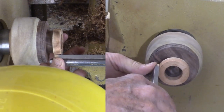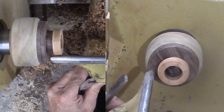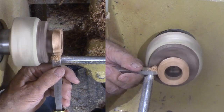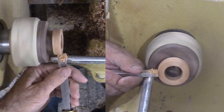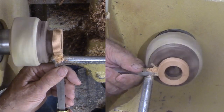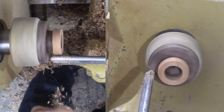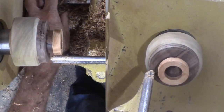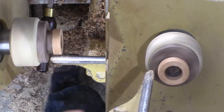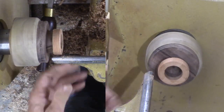As for the lathe speed — get over it. Remember that RPM is a measure of rotation speed. The speed of wood under the tool depends on rotation and diameter. For example, 300 RPM with a 3 inch diameter is about 900 inches per minute. At 5 inches diameter that is about 1500 inches per minute. At 1 inch, that is about 300 inches per minute. I slowed my lathe down to minimum, then up just a little until it seemed comfortable. Do not depend entirely on RPM.